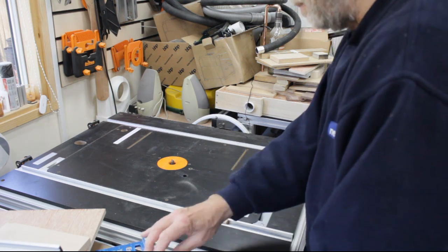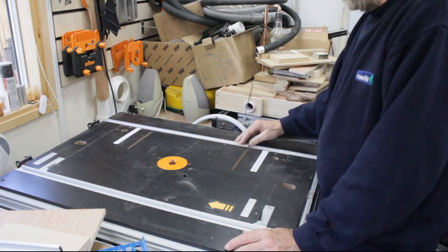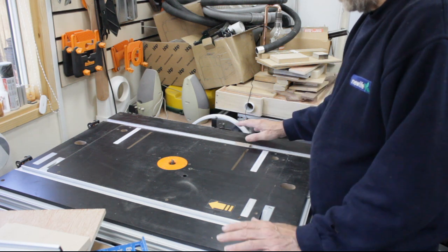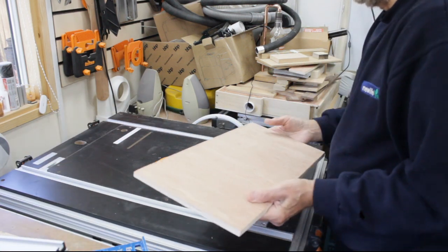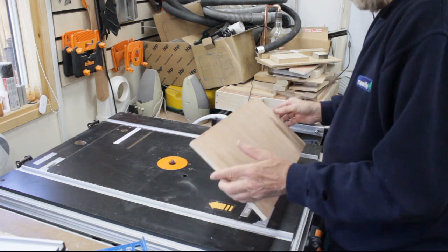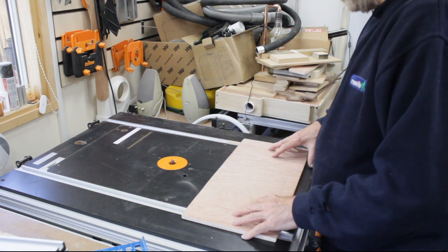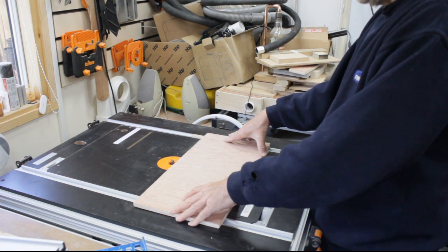If I make some blocks of MDF or something like that that will slide in those grooves, it doesn't matter that they lift out, it's only to locate it laterally. I can effectively do the same as you would for a circular saw: make a table or a flat plate that goes on top with the front and the back rail to hold it together, and then you run the router right through it, so you end up with a slot down the middle, just the same as you would with the table saw sled.